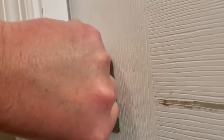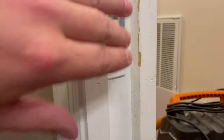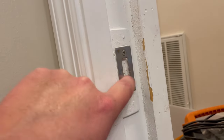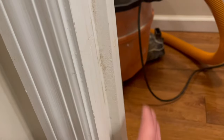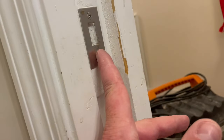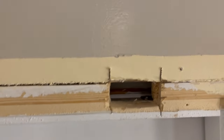So, there it is. We were able to just adjust this, and I've learned that this door jamb is not totally plumb, so I'm going to leave this striker in instead of digging it deeper in there. Plus it gives a little airflow through the pocket so that the bathroom fan can pull air through. But that's going to work now that it's clean enough to catch. This is all flattened out so it can actually catch. I removed that striking area down here that was causing the door to butt up against it because the door frame is out of plumb like this, just a tiny bit, and it's enough that this part of the door was always striking this and never reaching this. Plus, of course, the door was out of adjustment, so the latch was hitting super low and could have never hooked up over this. So now I've got good access up here for adjustments in the future.